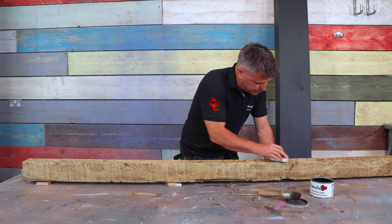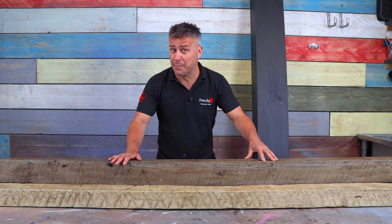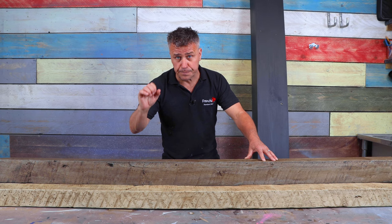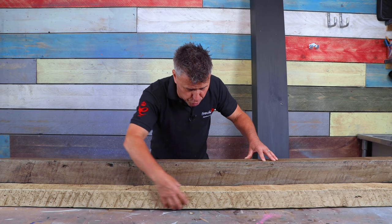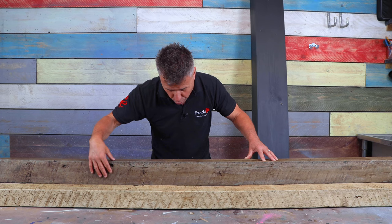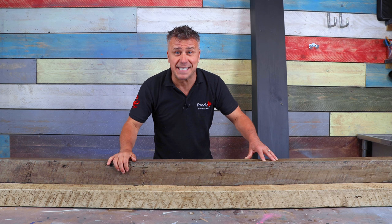Now these two beams started off exactly the same — both had a matte black paint on them, quite dull and uninspiring. I gave them the same type of TLC: cleaned them down with the sugar soap, then applied the Creme de la Creme — two coats on this one, just one coat on that one. Let that dry, then applied a coat of browning wax — a nice heavy coat on each. Within about 10 or 15 minutes, I wiped one off with the sponge to make it lighter, and the other I left, which gave a very dark effect. The choice really is yours — you can go from the lightest beam right the way down to the darkest beam. All you need to do is experiment with it.